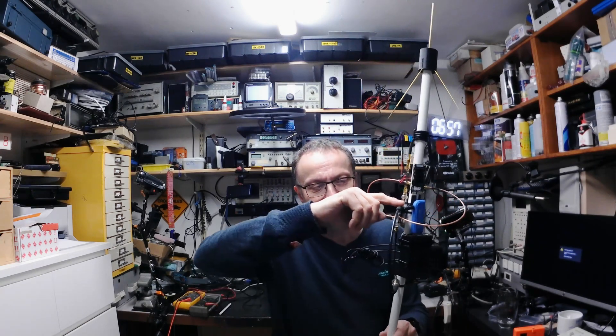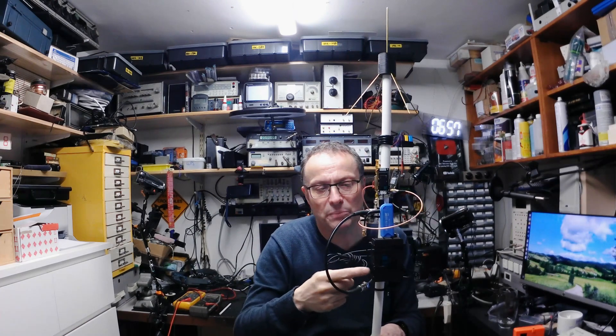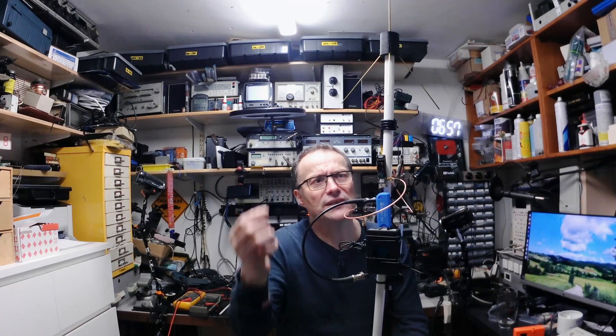The third output feeds this SDR module plugged into a Raspberry Pi. That's also running an APRS system called Ionosphere, and that's another iGate — so that's sending APRS information to the European server as well. Now I know what you're saying: why have you got two? Well, that first one is LoRa. This one is actually tuned to 144.8 MHz, which is the APRS packet frequency in the UK, using the conventional AX.25 APRS protocol.